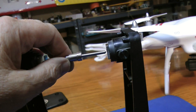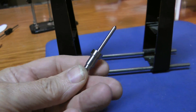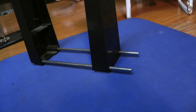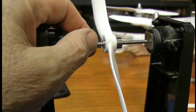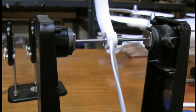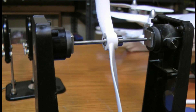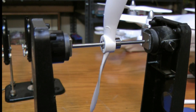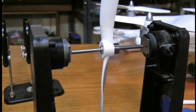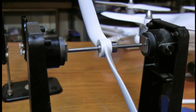You can see it's spinning and it'll take a few moments before it stops. It's starting to slow down — okay, there you go. Now, I've checked this arbor carefully with a tenth indicator and it runs within plus or minus a tenth of a thousandth, so I think that's as good as we're going to get. I'd certainly trust it before one of the other standard ones. So let me put a prop on there and we'll take a look. I'll give it a very light spin — this prop was balanced before on the other equipment, before I made this arbor. You can see it slowing down... okay, now check this — it stopped and went back the other way. So it certainly was not in balance.